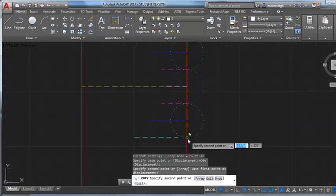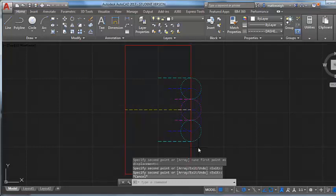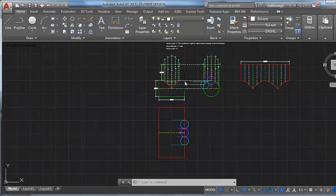I need this one down over here. So then I get this. I've only defined half the pattern because I've just pulled the information over here. This has the same information. It's just I never brought those across, and I don't really need them because I've got them here. If I was using a compass, I would set my point down here and make that little tick mark, and then I would have drawn these lines all the way across first, then set my compass down and marked on those lines, and it would have made these shapes on that side too.